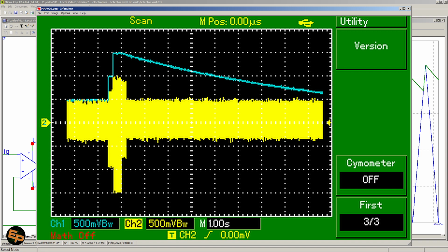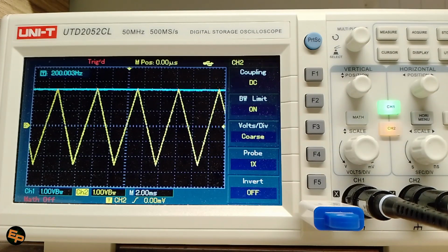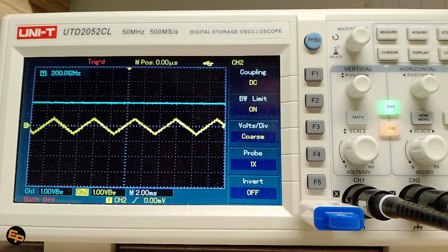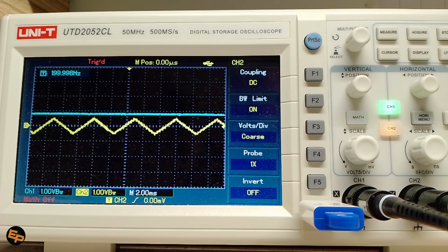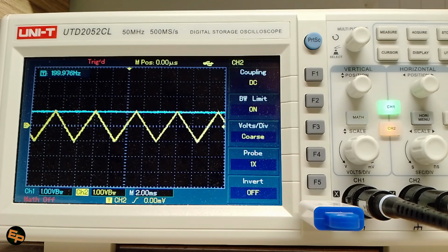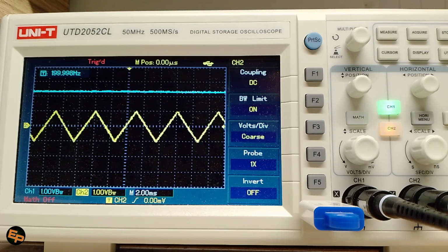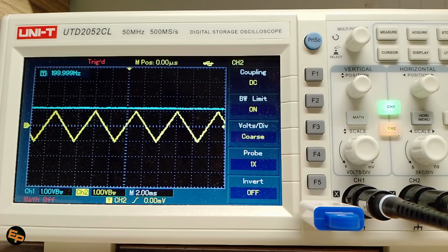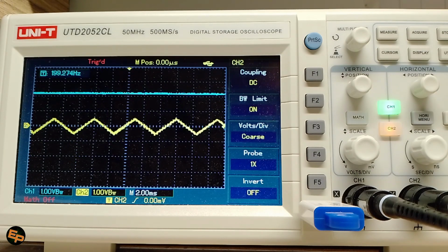Anyway, I can show you a lot better video, and you can see clearly how I start from a relatively higher amplitude and I decrease it, and then I wait, and yeah, with blue we have the output, which is the peak detection, with yellow the input. And as we can see, increasing the input increases instantly the output as well. Decreasing the input will decrease the output slowly. Again, we are playing with the time, with the speed from that capacitor and the parallel resistor with it.